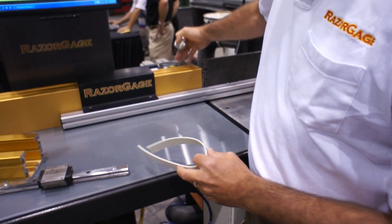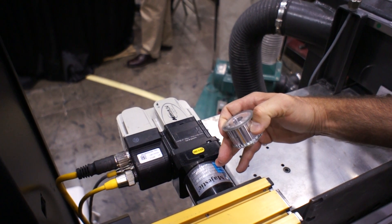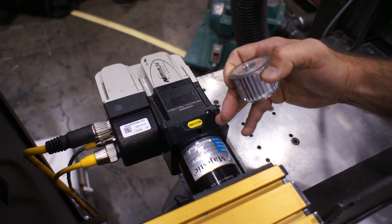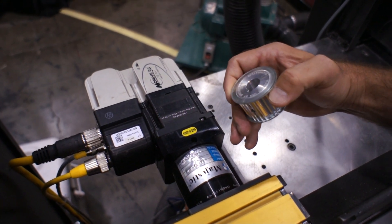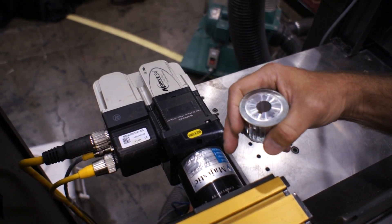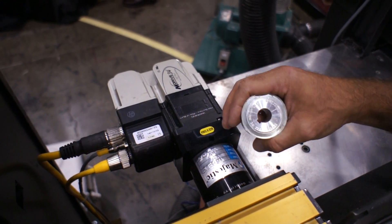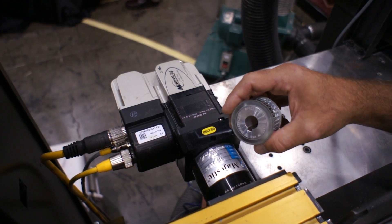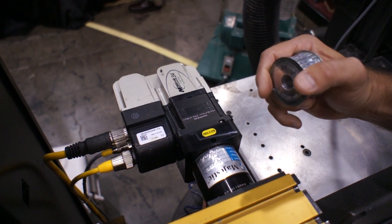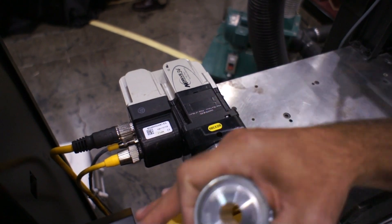The drive pulley is mounted to the gearbox. We use a planetary gear head — the same kind you'll see on high-end machining centers and machine tools. The planetary gear head has a sun gear and three planet gears around it, so you always have at least three teeth engaged in the pinion gear. Our competition uses a simple spur gear gearbox that's prone to backlash. So mechanically, our components are very sound from the motor all the way through to the carriage.